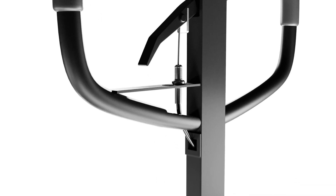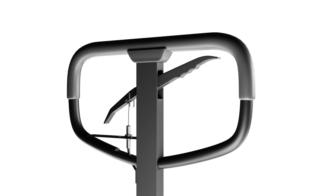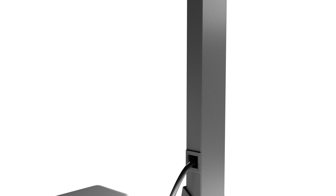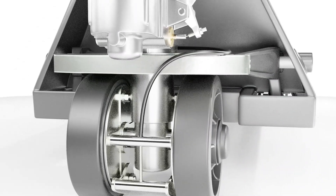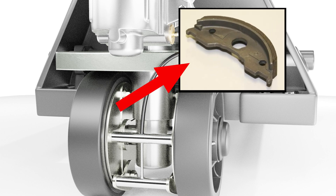Let's start with the hand brake. Hand brakes, typically located near the handle or control head of the pallet jack, serve as the primary braking system. These brakes utilize a lever-operated mechanism consisting of a lever, a cable linkage mechanism, and a brake shoe — or brake pads. When the lever is activated, it transfers a mechanical force through a system of linkages to the brake shoe, pushing it towards the wheel's circumference.